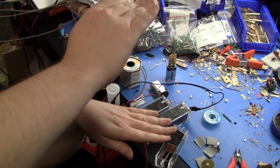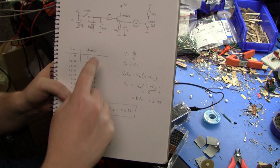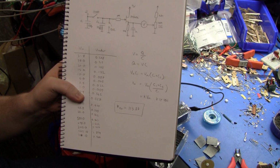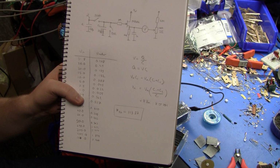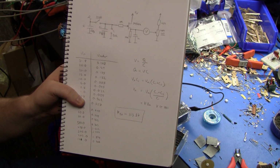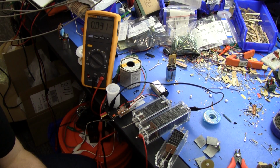And as you separated the two plates, the voltage would soar because the capacitance would drop. It's kind of the reverse of that, the V equals Q over C that we were talking about earlier. So if C drops and gets smaller, voltage is going to blow up. It's a very handy thing in the 1800s when we didn't have transistors and such to be able to measure extremely small voltages. Actually, no, in the really early days they didn't have moving coil meters, movement meters. So they couldn't really do it any other way. I think eventually they ended up with a quadrant electrometer that was far more sensitive, but the condensing electrometer for a long time was the most sensitive electrical instrument.